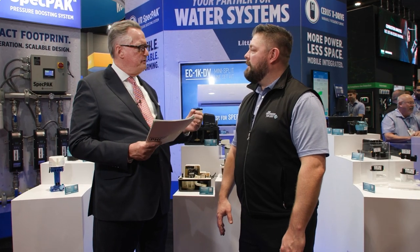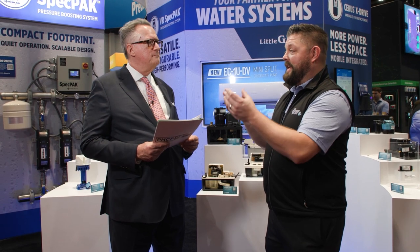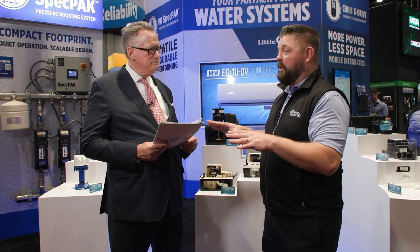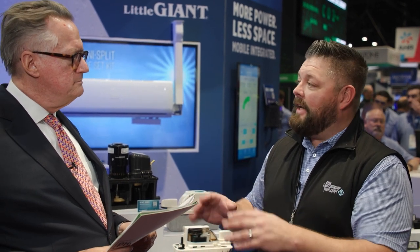How does this help the contractor precisely? How it helps them is basically the application and the installation. This is going to be just two screws — they mount it underneath the mini-split unit itself. All they have to do is wire it to the unit and put the drain inside there, and it's just a nice contained area. It's about ease of installation and ease of maintenance, which is tool-free. If you have to clean the reservoir, it has a nice hinge that drops down so you can get into the reservoir, clean it out maybe once or twice a year, and you do not need any tools to do that.